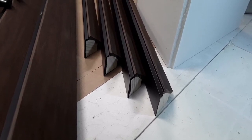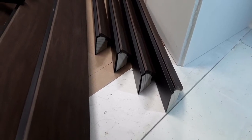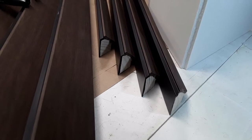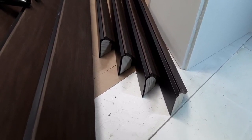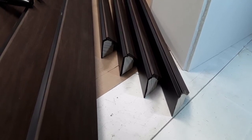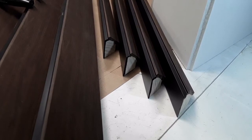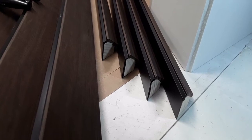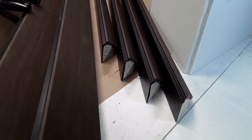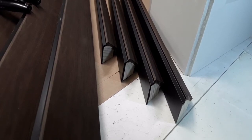These are brown and black frames, so there's been brown put on the inside to color the raw wood next to the frame edge, and then a black magic marker used to color the black edge — so that if there's any little variance, the raw wood won't show through and it'll be the same stained color as the face and back of the frame. Be aware that some frames made of very soft raw wood will wick the ink from the marker really fast, so you don't want discoloration showing on the face. Sometimes you have to color about an eighth of an inch away and let it wick forward, but not so far that it stains the front.